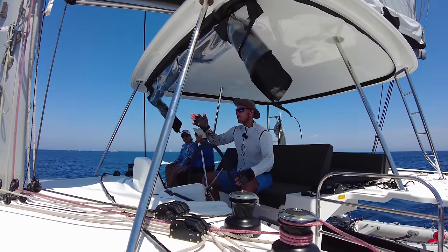Let's open this. So we have engine, we have water maker here, batteries. So this is the pressure pump of the water maker. And these are the membranes, these tubes. So this is making a high pressure. It's squeezed through these membranes, and then you get good water. This is the fresh water pump. We have a carbon filter for the water maker because you don't want to flush it with the chlorine water.